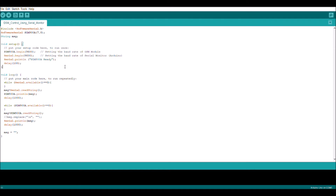The setup is pretty basic and straightforward. Next is the loop function. In the loop we have two while loops. The first while loop checks if there is anything in the Arduino serial monitor, and the other checks if there's anything in the GSM serial communication. The first one basically says: when the Arduino serial monitor is empty, do nothing — stay inside the loop. As soon as it receives something, it breaks out of that while loop and reads what was sent.